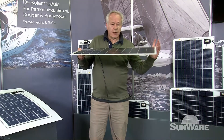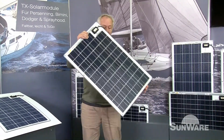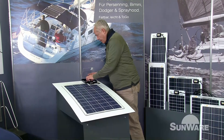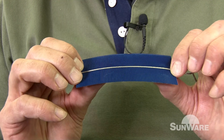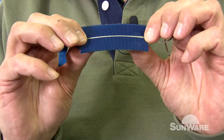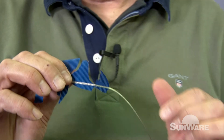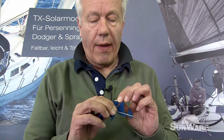On the other side, you can bend it 3 centimeters to a meter. I will show you just why we use an aluminium sandwich plate, and why you cannot bend it too much. To show you what we mean — 3 centimeters to a meter — you can bend the cell. Now you see it's just broken. You can bend it like thin glass, and if you bend it too much, it will break.